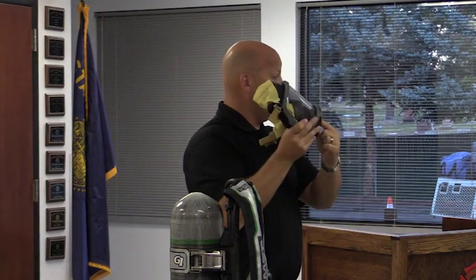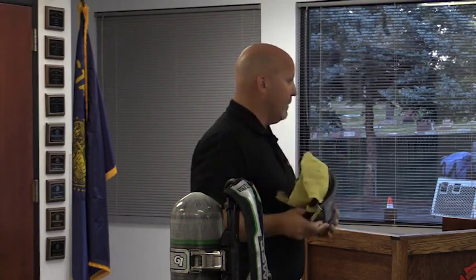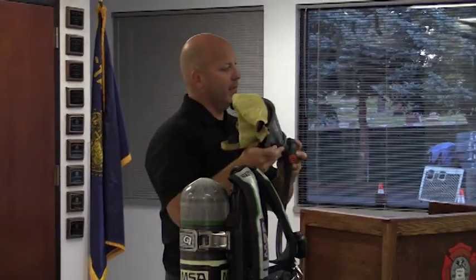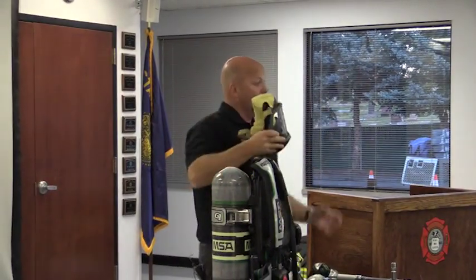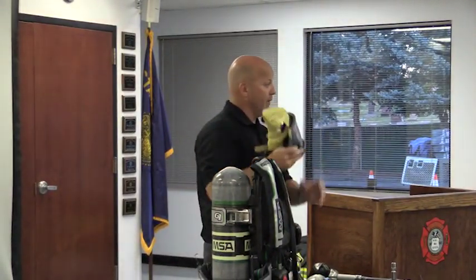Make sense? Yes, sir. In the light type, do you walk so you can see the illumination? Absolutely. If you were to take a foreign matter and put it onto here, the light can't shine through. So that's why here again, when we're cleaning and sanitizing the face piece, we want to make sure that this is clean. Generally, if it's clean enough to wear, you're not going to have an issue with that. When you're wearing the SCBA, debris cannot get into there. It would be when it's off, when these two are separated, then obviously you'd have issues with dirt, debris, whatever getting into there.